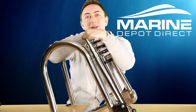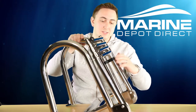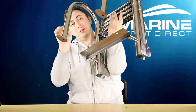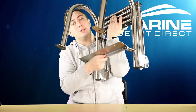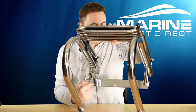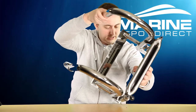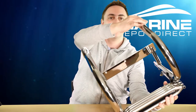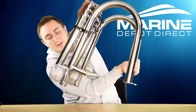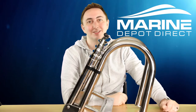It very securely snaps back into place when you're done, and we always recommend putting that bungee back on even if it is secured up and over. It goes right onto the edge of your pontoon — you've got to hit the edge with that little lip. This bar has three mounting holes, and fasteners are not included as with most of our products. On the end of each little foot there's a mounting hole as well, so once this thing is securely mounted on your boat, there is no chance it's just going to fall off.